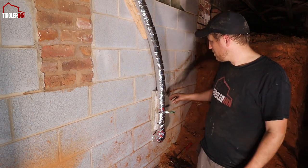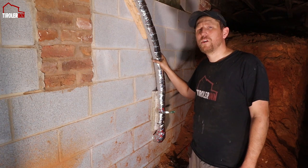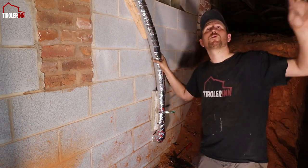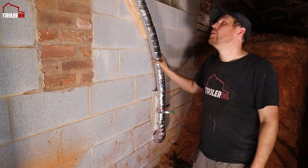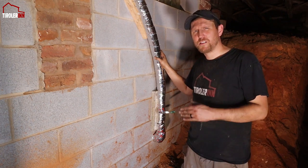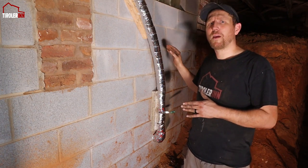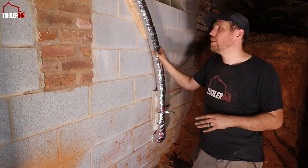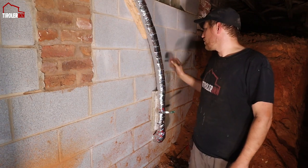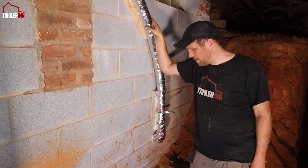So now what I did, I ran the pipe into the basement wherever I need to run it. I did the shortest distance that would be out in the open. So I just ran it up. I put it a little bit at an angle because it's easier with these PEX pipes that are already pre-bent from coming on a coil. It's a little easier to work if you're not doing completely straight runs. So I'm basically just curving around the ceiling up here.